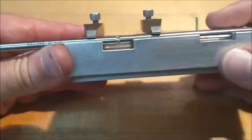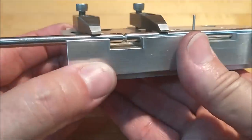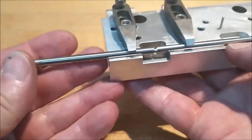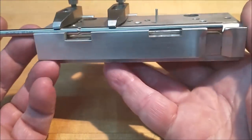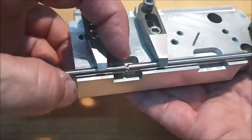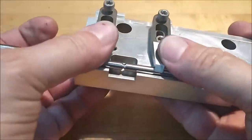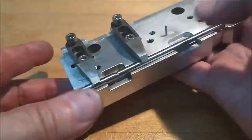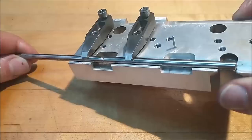I'm using the famous toe clamps to hold down rods for butt welding. Quite often here in the shop I need to splice the tip of one instrument onto the handle and shaft of another instrument, and this is 90% of the time the fixture I will use to do that. It keeps it nice and tight, gives me a lot of access for my torch, and I can just rotate the part, lock it down again, keep the warp out of it and build the weld up. When it's done you never even know it was spliced. Great little fixture, great use for the toe clamps.